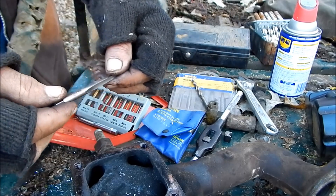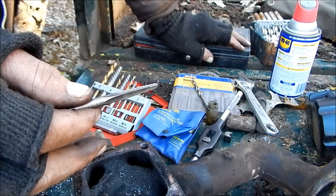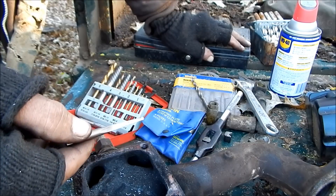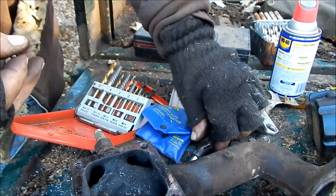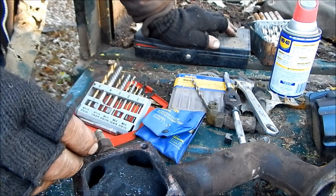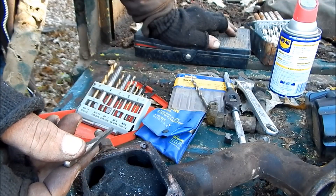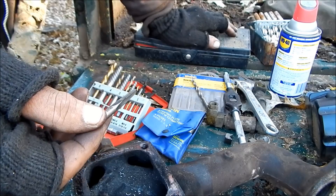Sometimes the straight easy outs work, but you've got to know how much pressure to use. The last thing you need is to have a soft bolt broken off in there and then break off a hard drill bit or easy out inside it — then you really have a mess because you can't drill them out. Use some restraint. Use a tap and die handle so you have control over the angle. You want to go straight in. These easy outs are hard materials, so they'll either chew the bolt up or they'll snap off. And snapping off is bad news.